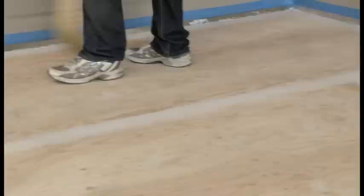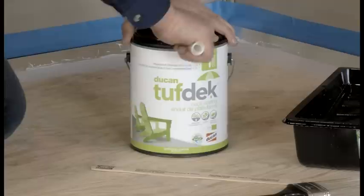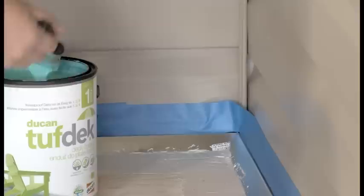The masking tape on the siding should stay in place to protect it from the application of step 1 to step 3 on the can strip. Be sure to sweep the deck prior to applying the primer. Stir the primer well. With the paintbrush, brush a generous coat of the primer onto the can strip and flashings.